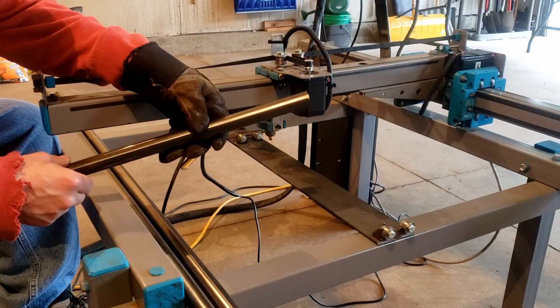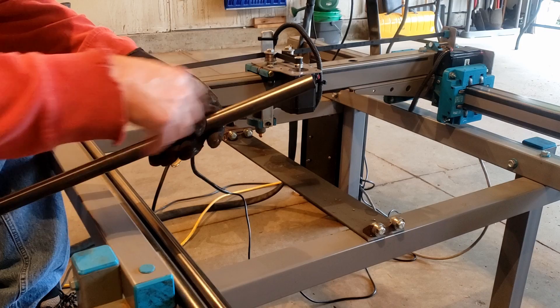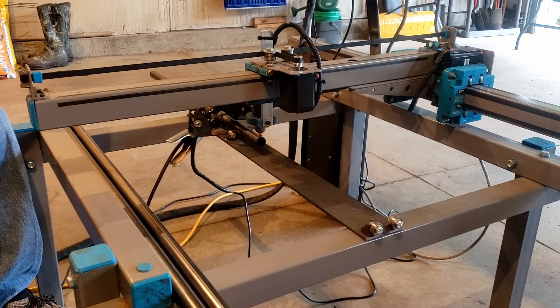These are the hoops for the rear frame and we've cut them to length, so we're going to set zero right on the end here. These are too long to cut the length for our device so we did cut them to length. On this one it has the bend line in it so we need to start the zero point on the bend line. We're ready to roll.